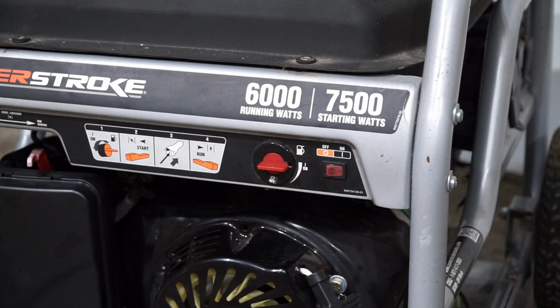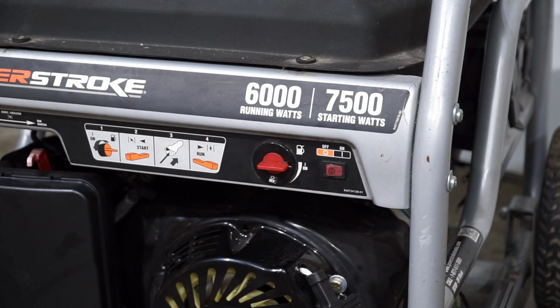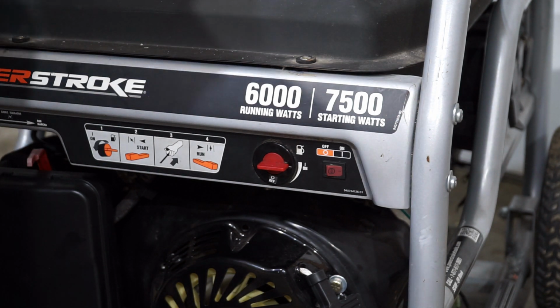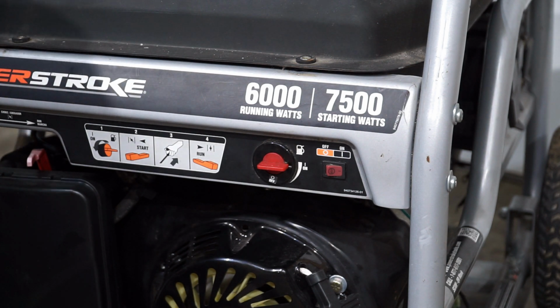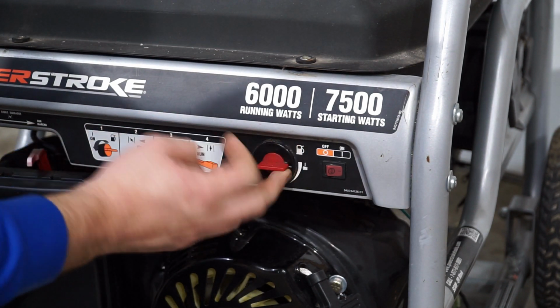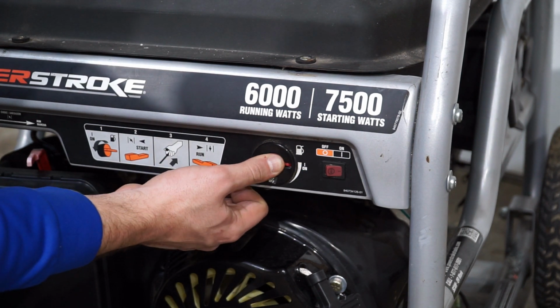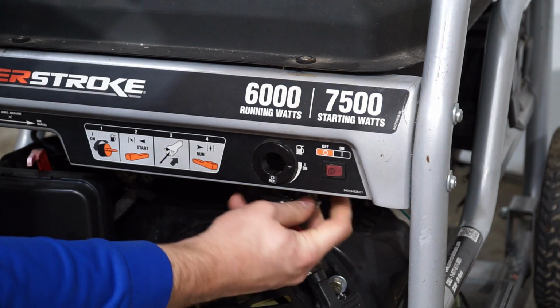All right, the fuel tank is essentially free now. All we have to do is free the fuel line and this will come off. So this fuel shutoff valve is kind of just a friction fit in this front housing. So if you line it up with this notch in the plastic here, you can actually just push this through. Then it's good to go.